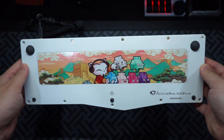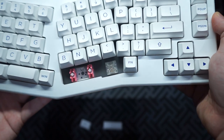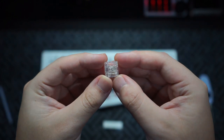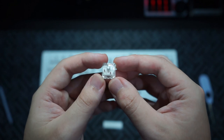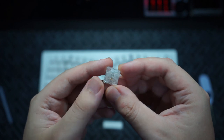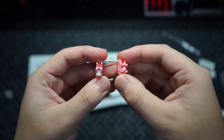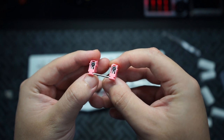The switches included are called the Echo CS Crystal switches. They have a clear look - hence the name. It's a linear type switch with an actuation force of 43 grams, total travel of 4 millimeters, and an 18mm long spring inside. They feel pretty smooth out of the box but are unlubed. The keyboard is 3-pin hot swap with a cutout for the RGB LED. The stabilizers are the new Echo stabilizers - plate-mounted stabs which are pretty good. I got the pink variant and they come factory lubed already with a little bit of lube on the stems and wires.